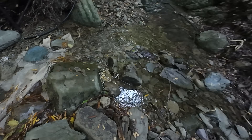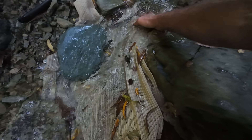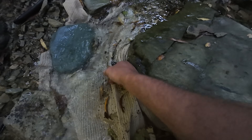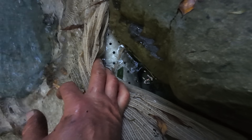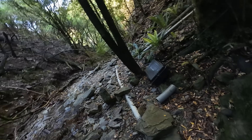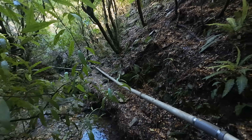There's plenty of water in the stream. That's the intake down there — it's got a few leaves on it but not too bad. No problems there and I can see that water's going into the holes. So there's probably a break in the pipe down there somewhere. Yep, the pipe's come apart down there.